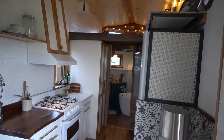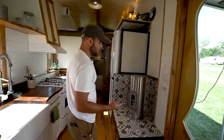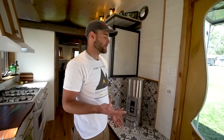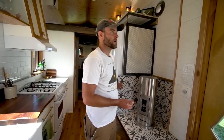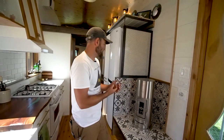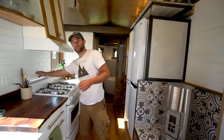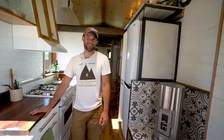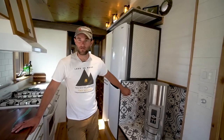It's all Portuguese tile that she found on special somewhere. A lot of people ask how tile holds up with road travel, and it holds up fine — it's all about the details. We use a product called OmniGrip for the adhesive — it's a modified thinset and that stuff is bomber. It's slightly flexible but the holding power is incredible. We had to redo one tile on the subway and I couldn't pull it off with a crowbar — I had to bust it with a hammer and chip it out, that's how good it is. For the grout, you want a modified grout with latex so it's flexible too.